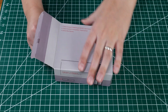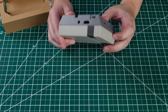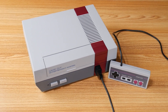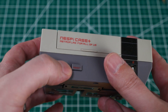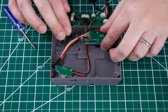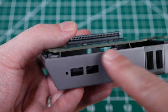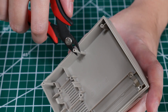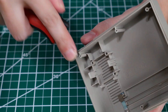Let's take a look at the case we're going to use. This is actually a Raspberry Pi case but Joe designed his PCBs to fit in here with a few simple modifications. The original consolized Game Boy was built into a full-sized NES shell which makes this the perfect upgrade — it has buttons, cutouts for HDMI and power, and even a functioning cartridge door. Inside we've got hardware to connect a Raspberry Pi but we don't need most of this so let's get it out of the way. When I try to install the main board there are some posts in the way that I need to remove, and some in the top half of the case that need to be trimmed too. I accidentally cut away more than I needed which means I won't be able to use one of the case screws, but it's not a big deal.